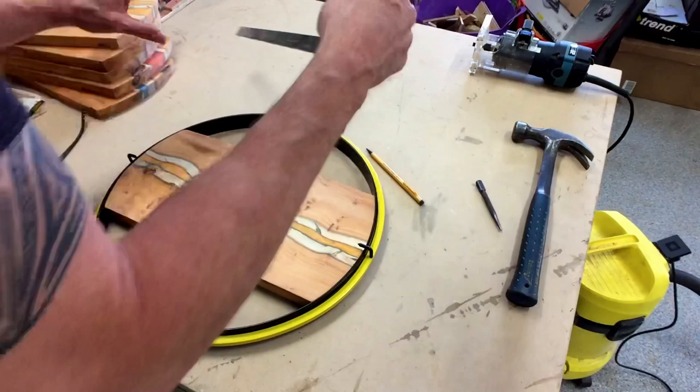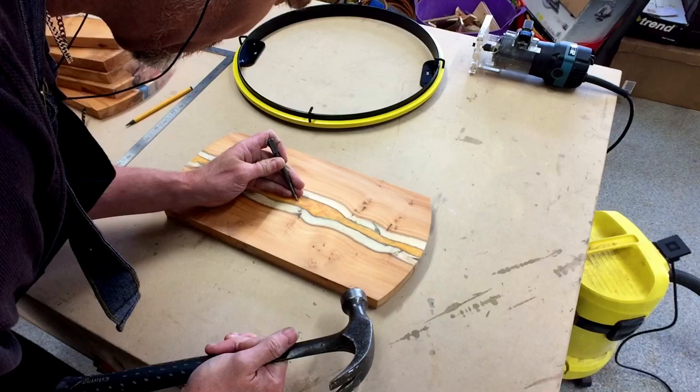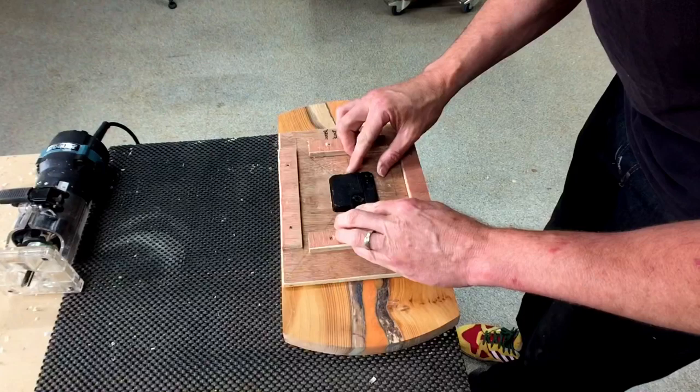Using the pointers and a straight edge as reference, I was able to find the centre of the clock faces and then just put a centre punch mark on there, transferring that across to the drill press. I got the hole nice and square, which is important so that when the shaft goes through it all sits square and the hands don't sit all wonky over the face. I made up a little router jig to allow me to get the mechanism in the right spot and then sink those into the back of the yew to the right level, and it worked really well.